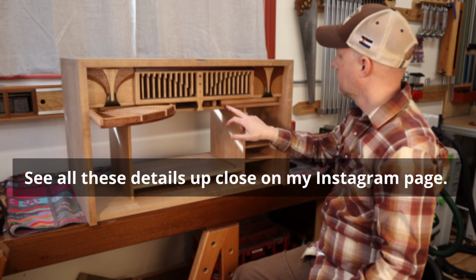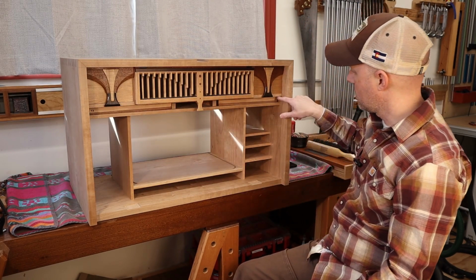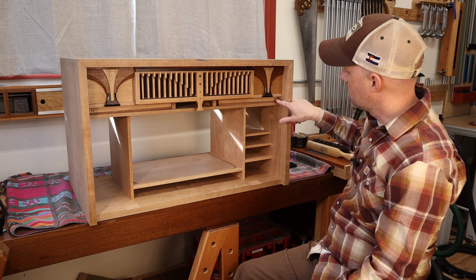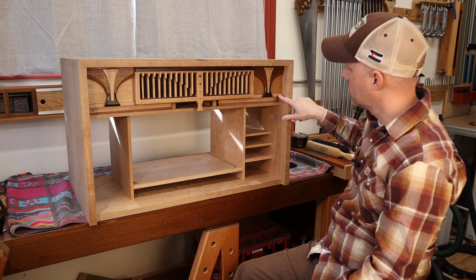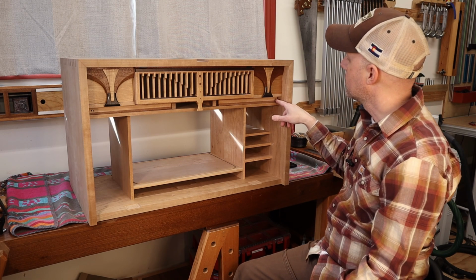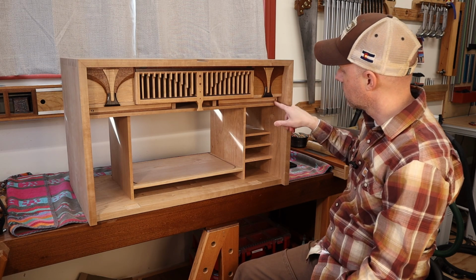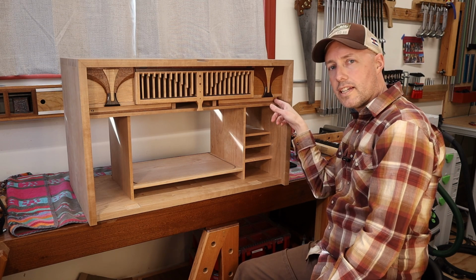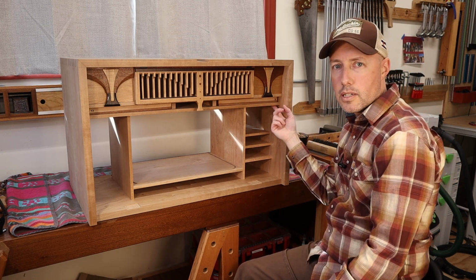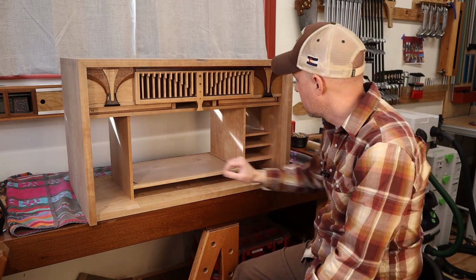And the way they fit in here is there's an oak, like half inch dowel through the pivoting drawer, as well as these two dividers. And then I slid that into place through all three of these things. And then I drilled a hole straight in and put a screw in there to keep the pivot from, you know, kind of falling out the bottom there. I have the rest of these dividers in place.